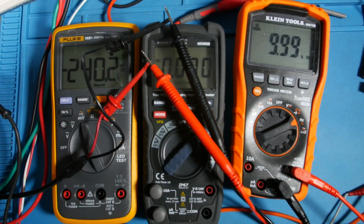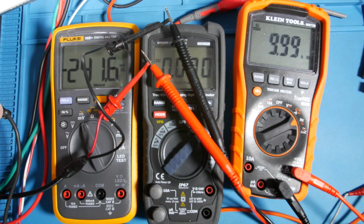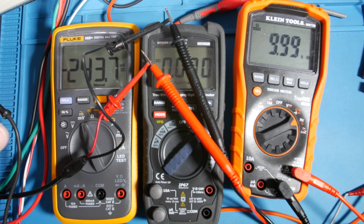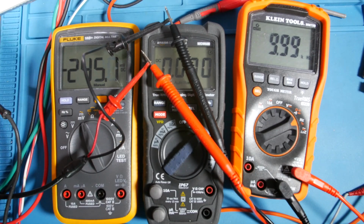Okay, so frequency, you can see it's almost 10 kilohertz. That's what my generator is set at. But also, 900 millivolts peak to peak. Okay, so it likes to have, so that's 318 millivolts RMS. So it likes to be over, I think, 300 millivolts or something for sensitivity level to pick up the frequency. It's not very much voltage, but it's just something to be aware of.